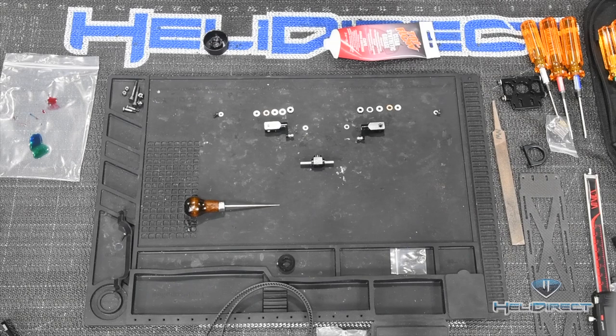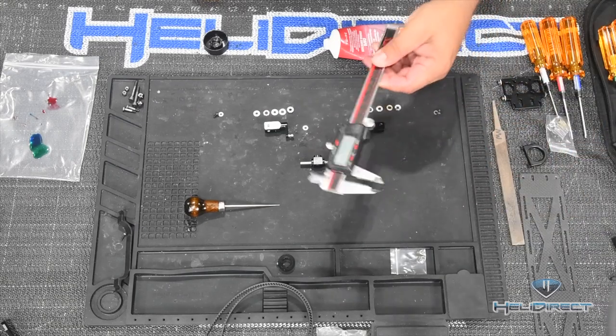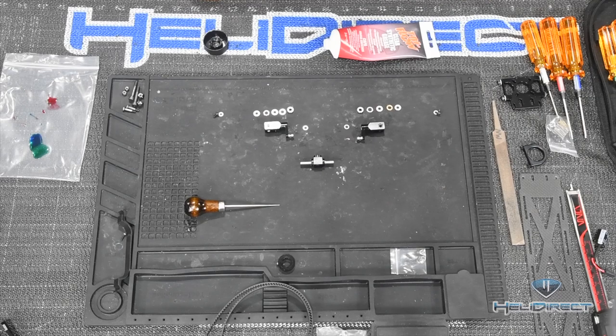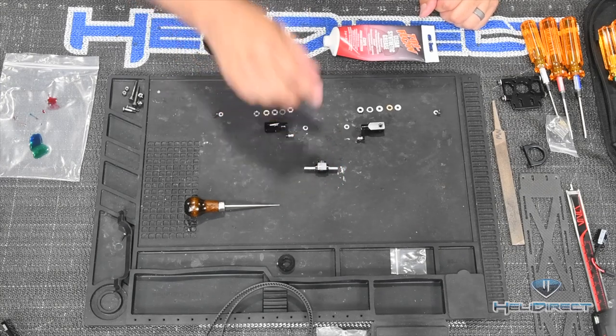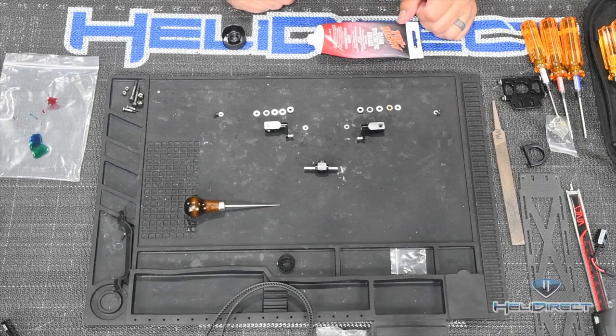But the other thing is, the manual is very good at giving you the dimensions of the washer, and when you have your digital caliper handy, you can always figure out which washer is which that way, by thickness, inside diameter, etc. Alright, so now we can take our center hub and tuck it away for now, and now we're going to work on our blade grip arms.